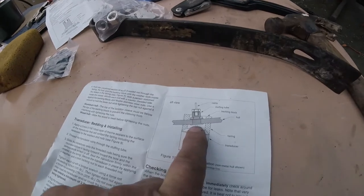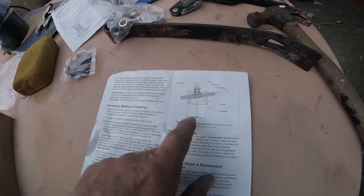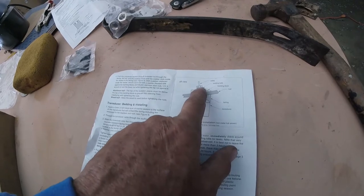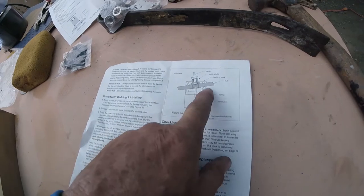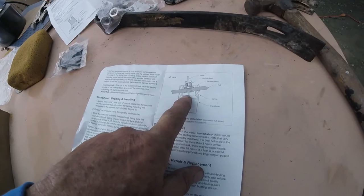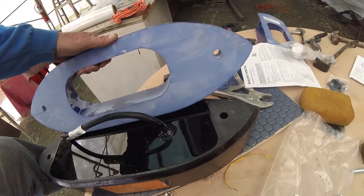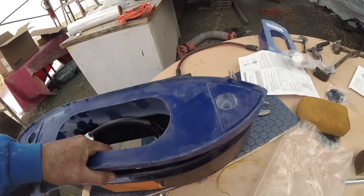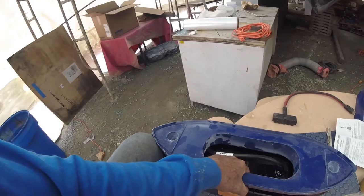And then to show you a side view, remember how I said you don't have to point that cable gland through? This is a view looking from the front. The cable just comes up, goes in the hollow cavity, goes through the gland, and into the boat. This is the hull surface, and this is the part that we've cut at an angle to match the hull deadrise. Look at the cable, how there is no stem, and it just sits in the middle of this cavity here. The bolts that go through here and the bolts that go through back there, that's what holds the transducer on.